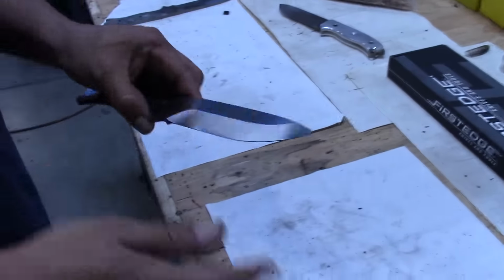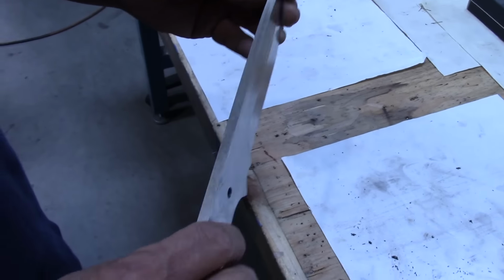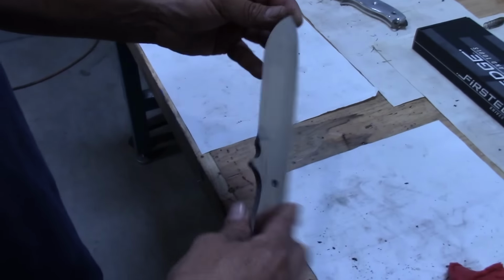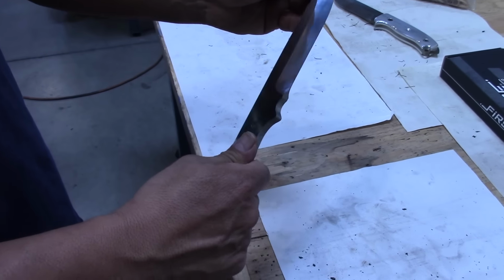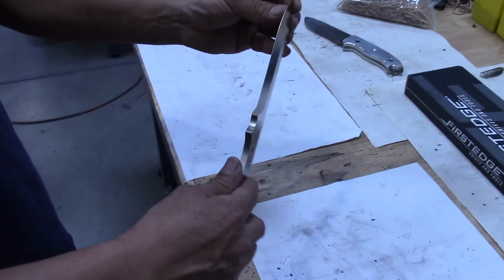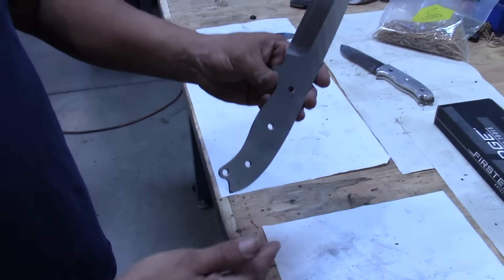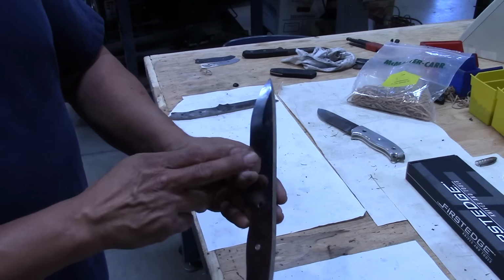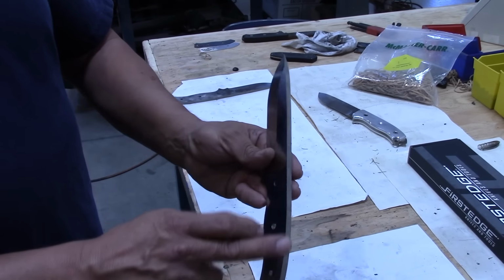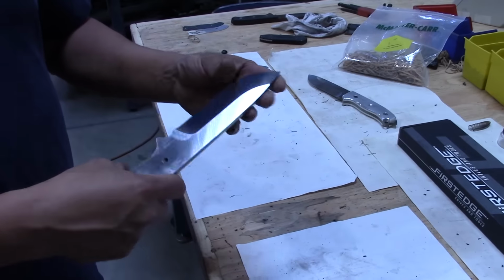So now, after the blades come out of being milled for the proper angle of the grind, here's what it looks like when both sides have been milled out. Yes, both sides are flat ground. So after this, then it will go into the tumbler machines and tumble out all the final sharp edges, then it'll go to the other treatment for black oxide.